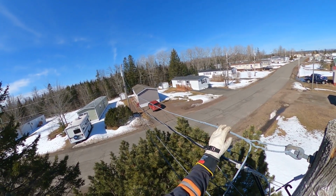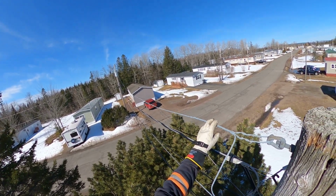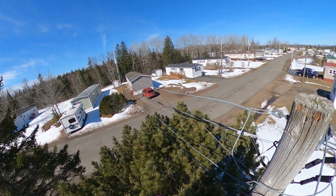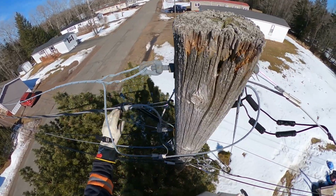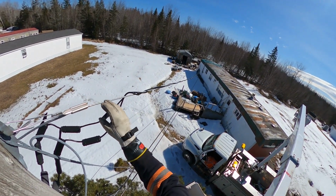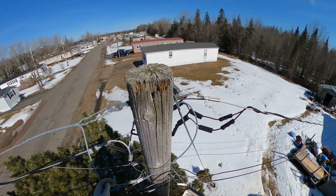We've got this guy wire that's slack. It does have an insulated epoxy rod near the high voltage on the other end. However, that could be a hazard. We should resag and tighten that up. I'll get a crew here actually to repair some of these deficiencies, as they're not an emergency right away. All we're going to do for today is get rid of the service wire, clear all the wires from the home, including the communication wires, so that the demo crew can work safely.